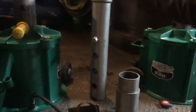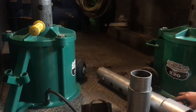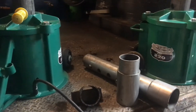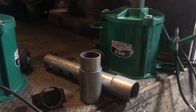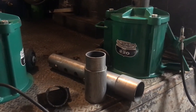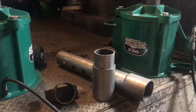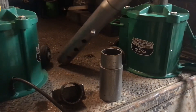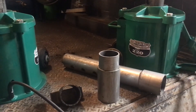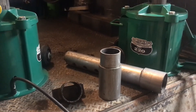As for the taller extensions, same thing - it's just a piece of pipe with a piece of pipe welded to it and a rod through with a couple holes drilled through, so you can adjust to different heights. This company also has oil drains and drive-on ramps and all that kind of stuff - they seem to be an agricultural-based company. They make extensions that are like four feet tall for picking up field sprayers, because of course the bottom of those things is like six or seven feet off the ground.